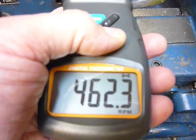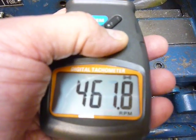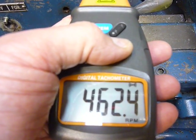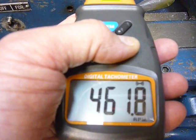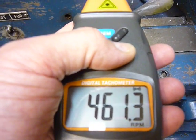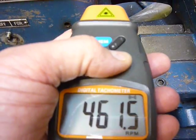It's probably a little extra slip in the motor at one frequency or another. The motor was designed to work at 60 hertz. This really just gets me in the ballpark, as was originally intended with the lathe. Those numbers from the gear ratios — I've actually calculated them and they're not exact, they're just close enough. They round up or down on the chart. The idea is just to get machinists in the 60s pretty close to where they need to be.